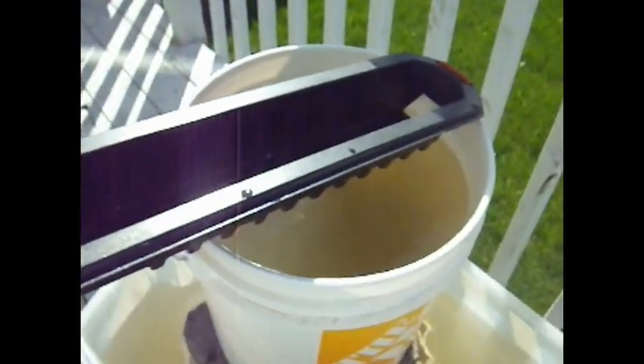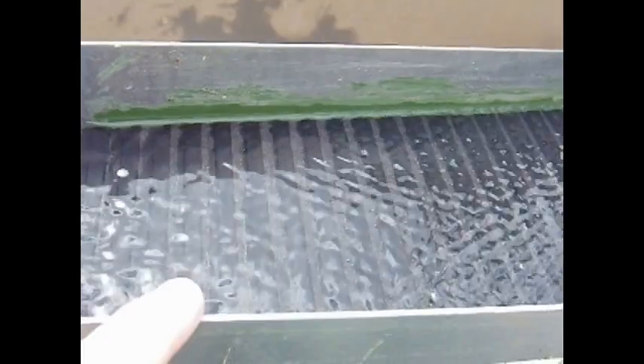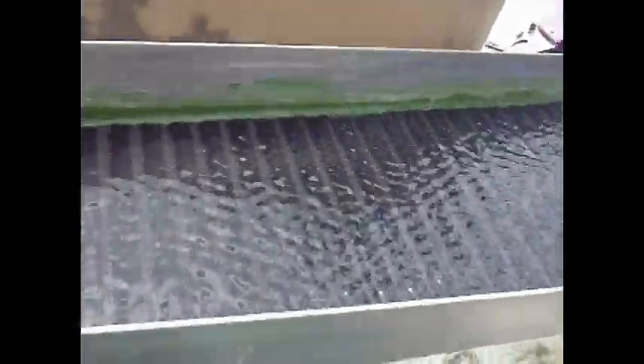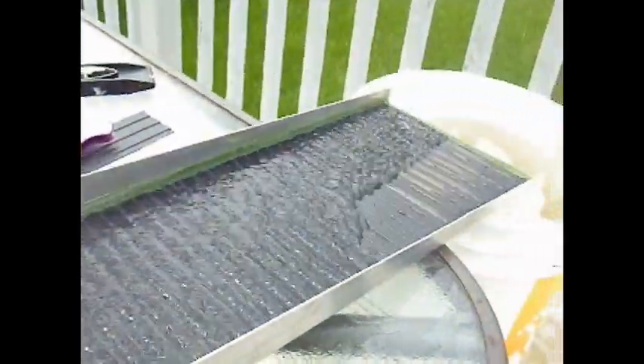There's lots of bigger gold in my plus 70 material but also a lot of mid-range and even fine gold — I think it just didn't classify well enough, but that's okay. I'll get the ultra-fine stuff and whatever doesn't make it through I'll get in the second round, then do the bucket again last with everything to see if I missed anything. I added a 90-degree corner to take out some of the air from a kink and it's working a lot better. I've also changed to a wider-spaced and slightly deeper matting in the cleanup sluice. I've reprocessed all of it and I'm picking up a tremendous amount more. I'll definitely have to also switch to the half-inch expanded metal in my main sluice — I'm just throwing too much of this particle gold back up into the slurry.